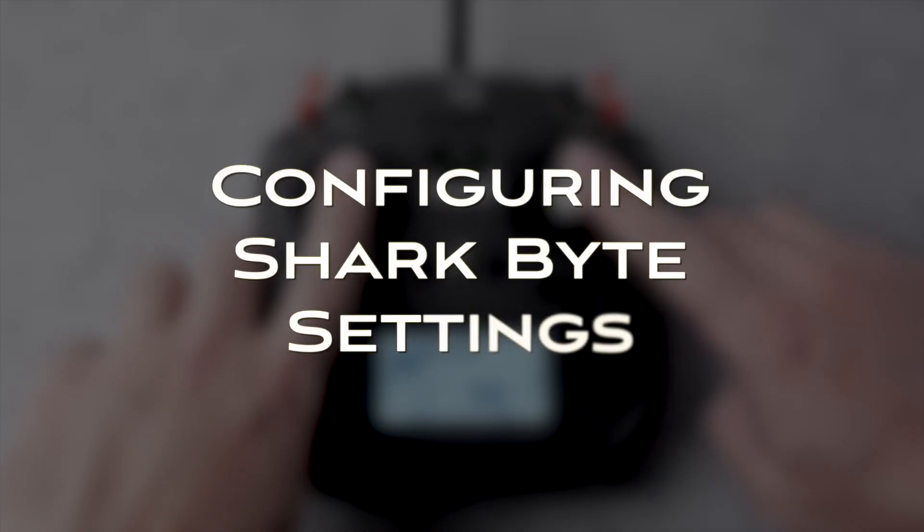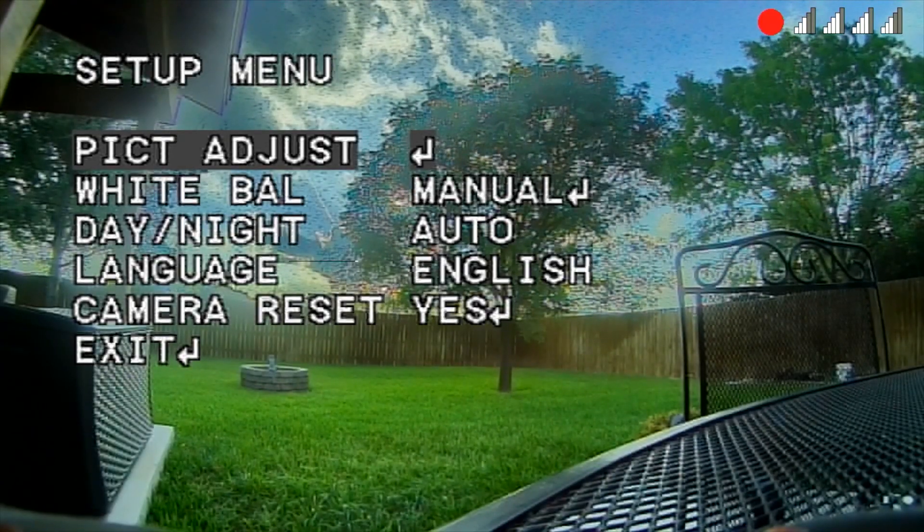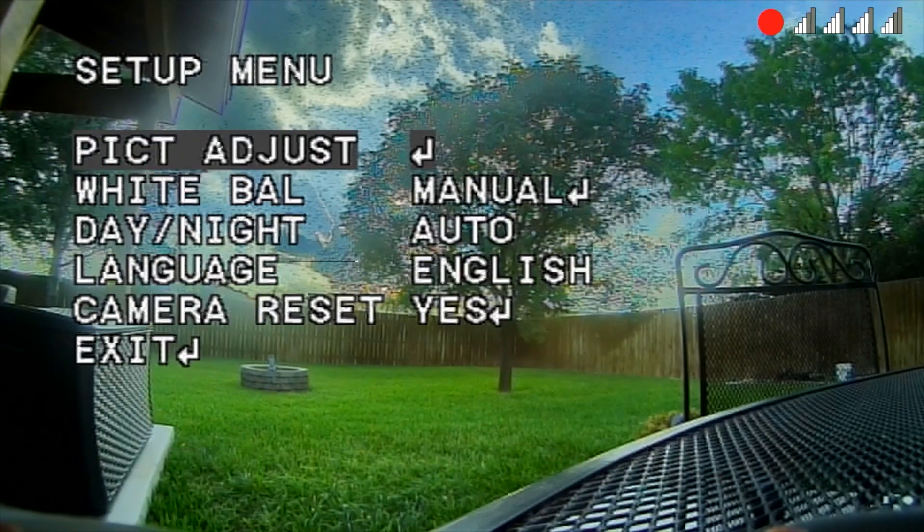This should be all you need to do. So if you power up the drone and power up the receiver, you should see the receiver auto-search for channels and find the one your VTX is transmitting on. Everything should be ready to go, so you're pretty much ready to fly at this point. But I want to cover one more thing, which is how to adjust the camera and VTX settings. It's pretty easy because you can do this with your transmitter. To get into the camera settings menu, you just need to hold the left stick all the way to the right as if you're yawing all the way to the right. That'll put you into the settings menu and you can adjust all of the camera parameters there. In my case, I had actually installed my camera upside down, so I needed to use one of the options here to flip the camera image 180 degrees. There are a lot of other settings here that affect the image quality and I might do a video on all of them at some point.